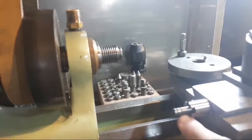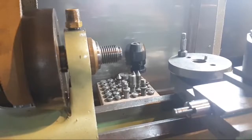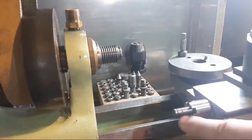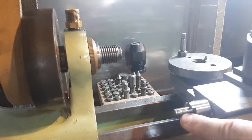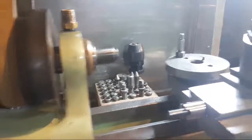Hardened and tempered this today, about 57 RC, half hour at 1450 Fahrenheit. This is 780 degrees Celsius, and then quenched in brine, and 2 hours at about 590 something Fahrenheit. So that's pretty nice. That's just where we need to be. That should be pretty tough and not wear out with that detent clicking back between those two grooves. So that was a job I did today.